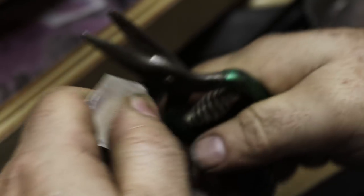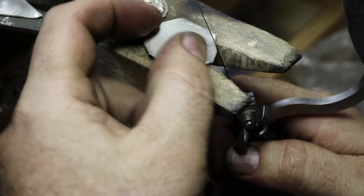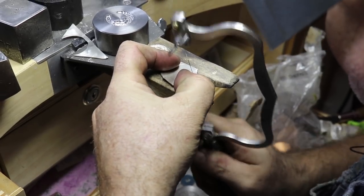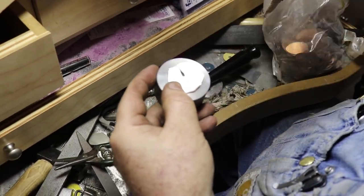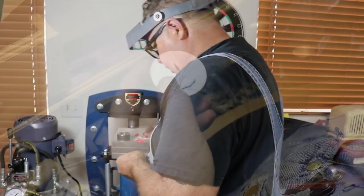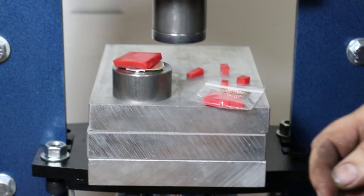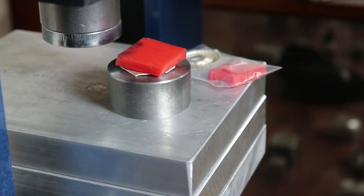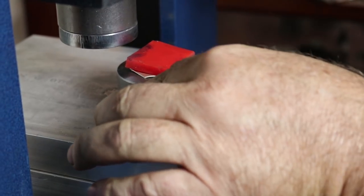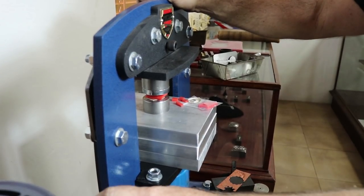If you can remove a lot of this metal it'll allow it to flow into the die better. I'm going to saw out the middle here real quick — this has already been annealed. All this is going to do is enable the metal to flow easier into the die. When you do this you always have to center your work and you should be using spacers.